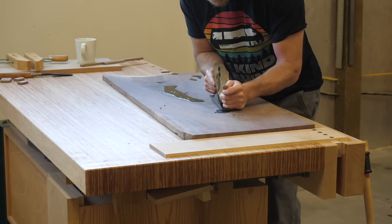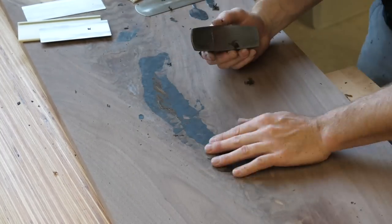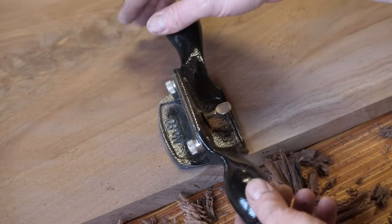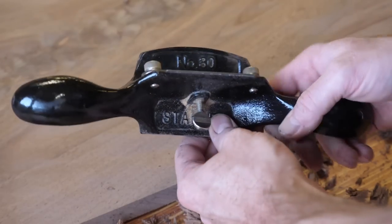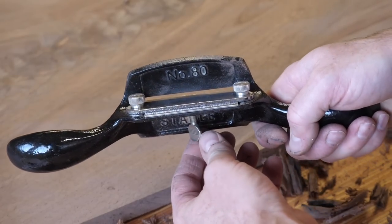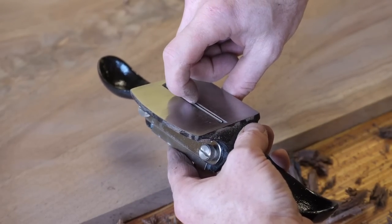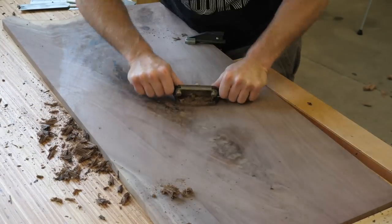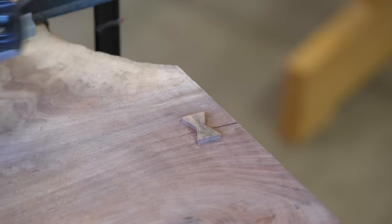I use a variety of instruments to level the now-cured epoxy, including hand planes, block planes, and card scrapers. I'd like to call out a tool you may not have heard of — this is a number 80 cabinet scraper. It cuts the same as a card scraper, meaning it uses a burr rolled onto the edge of a piece of steel, with a thumb screw to put a slight bow in the steel allowing the burr to catch as it's pushed across the wood. The sole prevents too much dishing in one area — a card scraper if not used correctly can dig a pretty big dish. For a surface that needs to be nice and flat, consider a number 80 cabinet scraper.